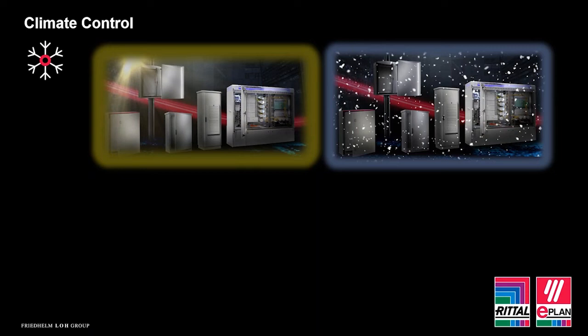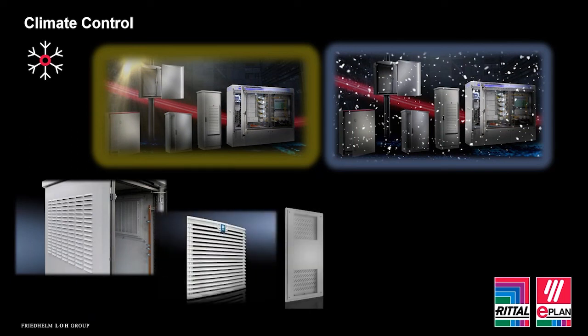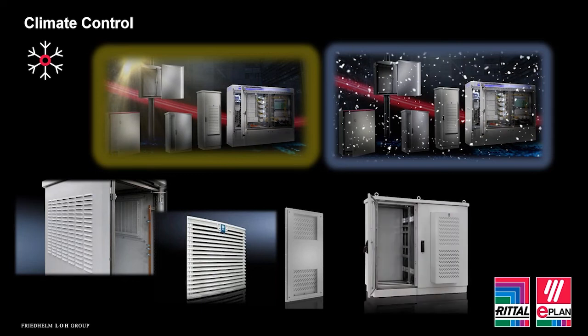In today's technology, this equipment can work at considerably higher temperatures, so it might be that all we need is passive cooling, such as louvers in the enclosure, or active cooling, such as a fan and filter, like the one shown here that also has a special outdoor fitting. However, if the equipment is more sensitive to temperature, such as telecoms or IT equipment or UPSs, then they may need to work in a much lower temperature in order to work at their optimum. In these situations, then we may need to consider a cooling unit with a refrigerant circuit, like the one we can see here fitted to the door of the enclosure.